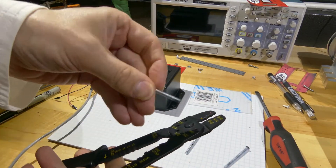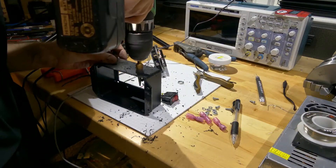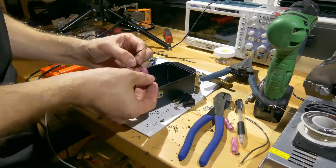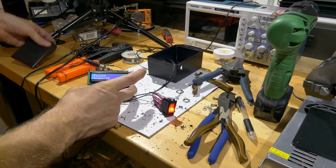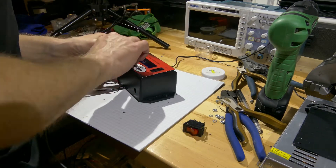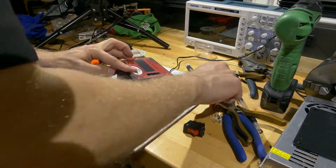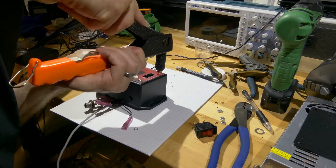Here I'm cutting the tapered screws to size, and now I'm drilling a hole for the foot pedal to plug into. This foot pedal actually uses a quarter inch headphone jack. One of my favorite tools is this auto stripper — it makes stripping wires super easy. This is my first power-on test, and it looks like everything is working great. Next, I mounted the Arduino Uno and the keypad shield and did some final cleanup and fitting for the label. I put a thin layer of plexiglass over top of the label to protect it, then riveted everything into place.